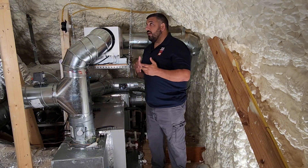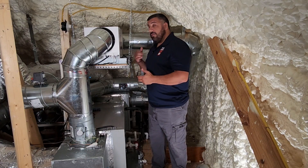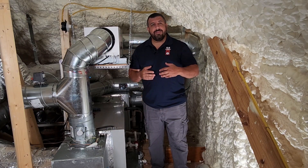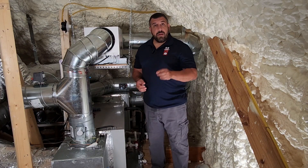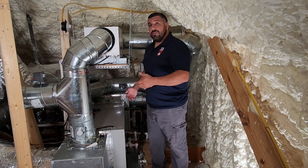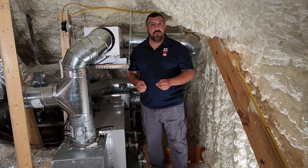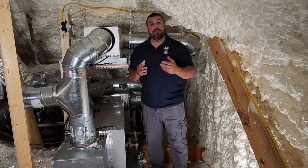It's important to note that I've also done a lot of things to make sure my Bosch heat pump doesn't have a lot of moisture to get rid of in the first place. I've got a really tight building envelope. I do pull in fresh air, which has a lot of humidity, but only when the indoor air quality requires it. I've also got a small dehumidifier — the smallest one that Santa Fe makes — to help dehumidify the house during mild humid weather when the call for air conditioning just isn't there to get compressor runtimes. I hope you can see that with just a little bit of setup and understanding how the Bosch system thinks, you can get really good performance out of this middle-of-the-line 24-volt non-communicating model. If you're a contractor interested in getting more out of Bosch systems, let me know and I'll be happy to help design a system that works for your clients. And if you're a homeowner in the Cape Fear area, Brunswick or New Hanover County, North Carolina, I'll be happy to be your Bosch HVAC contractor.